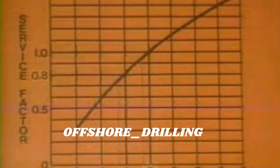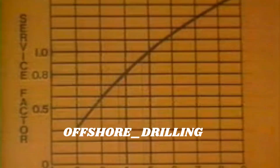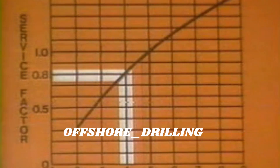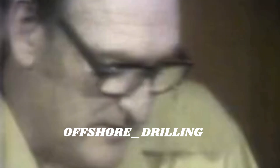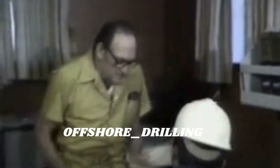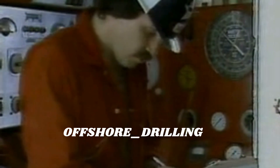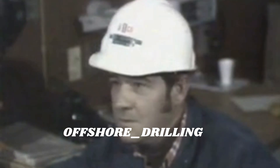The figures on this chart are accurate only if you maintain a safety factor of five. If you consistently operate at a higher or lower safety factor, you can modify your cutoff figure using the wire rope service curve found in the drilling manual or API Bulletin RP9B. A safety factor of five gives you 100% of the ton mile figure in the cutoff chart, but if you maintain a safety factor of four, you should expect only 80% — 0.8 times the normal cutoff figure. Remember, the figures derived from this chart are merely recommendations. Based on your experience, equipment, and drilling conditions, you may set a slightly different target figure. Things like bit chatter, hole deviation, and stuck pipe can occasionally crop up, resulting in excess unmeasured wear on your line, and may call for temporary changes in your cutoff program.